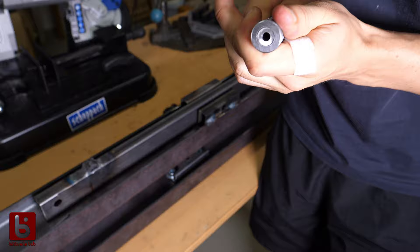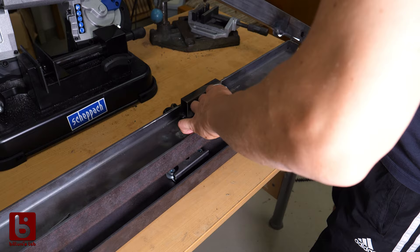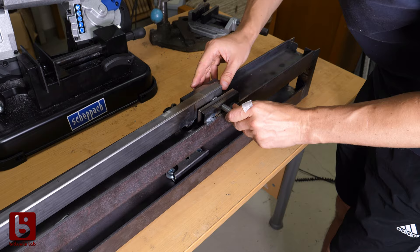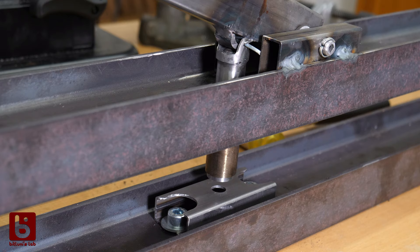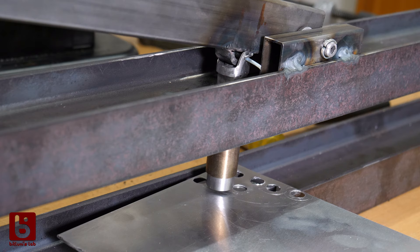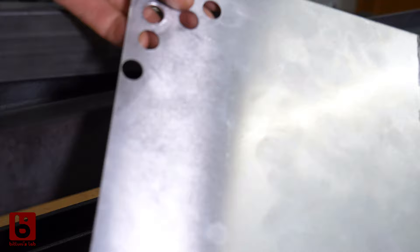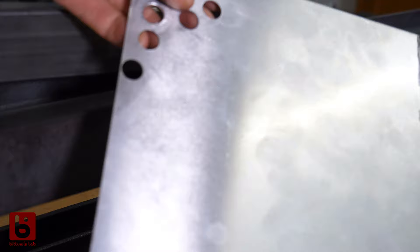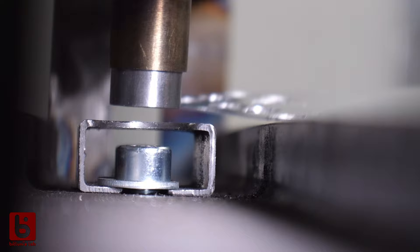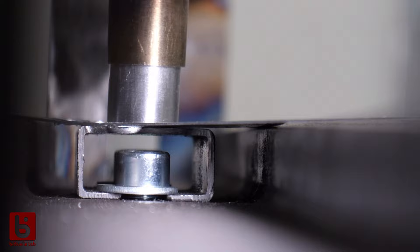This is the new version. As you can see, the center rod is always hidden now, so it will retract when the punch is released. I also welded the upper part, since the press fit wasn't strong enough at these forces. Let's test it. You can see how even these I-beams flex apart at these forces. Here is another view angle — the punch is a bit crooked, but it works nevertheless.